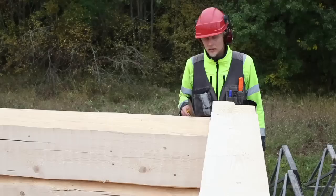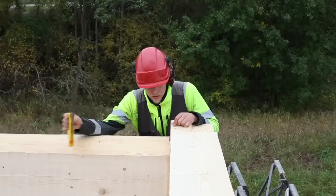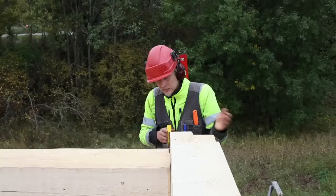I prefer to make the upper side of the notch before scribing the log. Sometimes gaps occur that can still be quite easily fit with just a regular saw and then tightened.